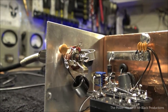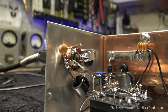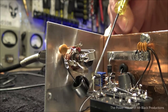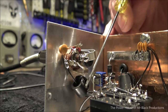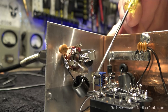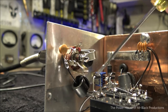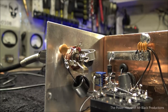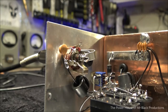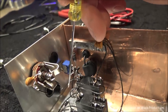Now everybody's going to say, well, the ferrite bead's enough. Well, in some cases it is. But if I end up having AC noise, I want to give that a different path to ground as quickly as I can, couple it to ground and help suppress that noise. The ferrite bead all that does is change the resonant frequency of the wire. So by increasing the resonant frequency of the wire to an infinite tune, plus the advent of the bypass caps to ground, we know for a fact that this line, which has now come into the system externally, is going to be clean and signal free.